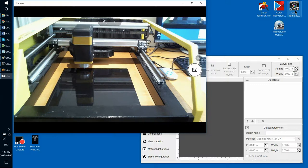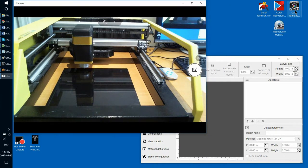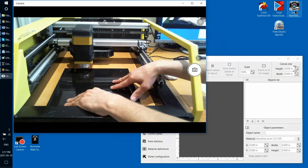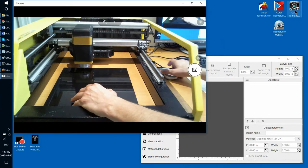However, quite often many customers do small proofs on tiles. Like this is a 12 by 12 inch tile, which can be very cheaply obtained at most tile stores and interior stone shops, and they are just regular polished granite, and they are very well suited for proofs. However, when you're doing the proof with such a tile, there are two things that can happen. The tile itself can wobble, like actually is the case here, and the tile can slide. If you put a tile on a smooth surface, it can slide during the etching job and cause distortions in your etching.